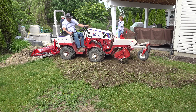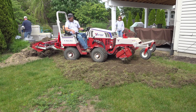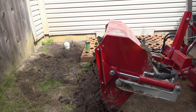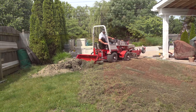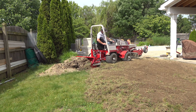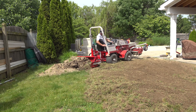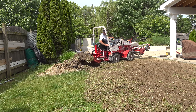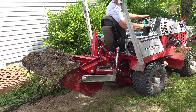I chose to use the power bucket again so that I didn't have to take two tractors. We've all noticed the tires squatting when we use the power bucket. I later checked and I had 11 PSI in each tire. After this project, I raised it to 15 PSI — I just couldn't stand to see them squat.